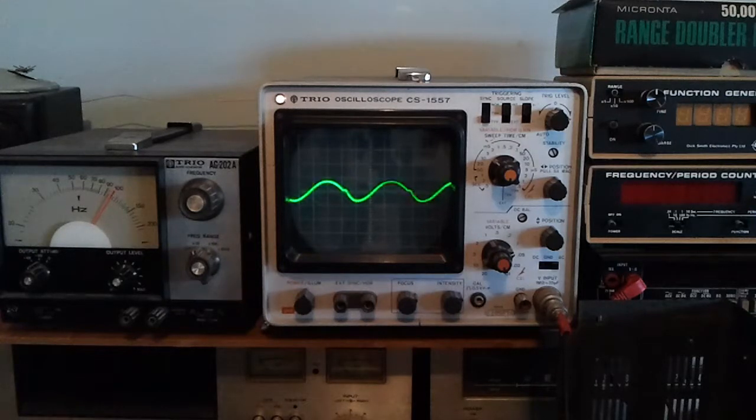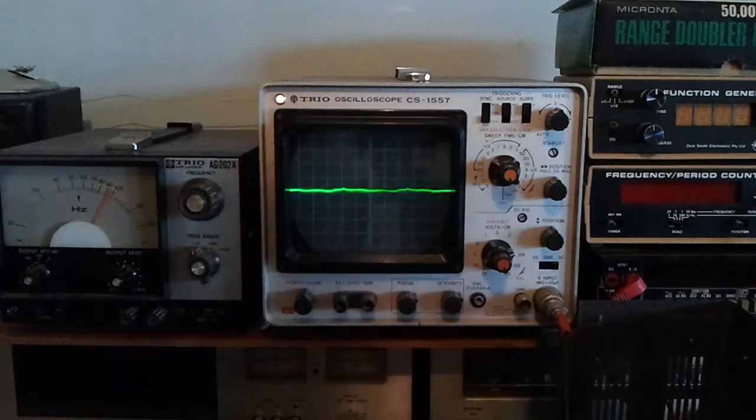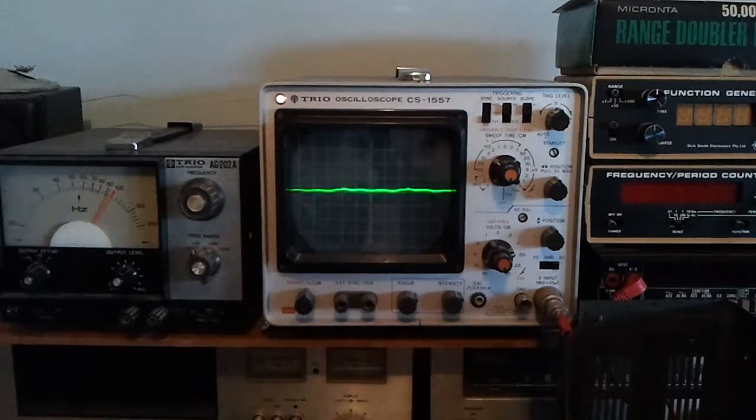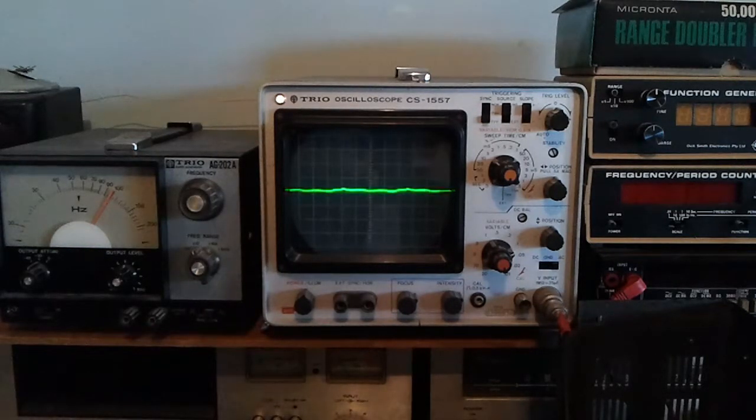Having this sort of 50 Hz hum coming out of the IF board is not good. If we go back to receive, it goes. So I might leave it at this stage for this video update. In the next one, hopefully I'll be able to tell you where the 50 Hz is coming from, and we'll have a look at what it is on the driver board — the 12BY7 — that's causing this distortion problem. Then we should be pretty close to getting the transmitter operating properly. Anyway, all the best in the meantime.